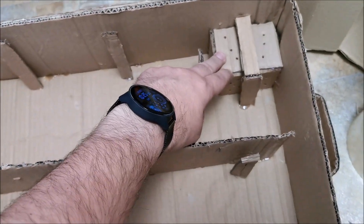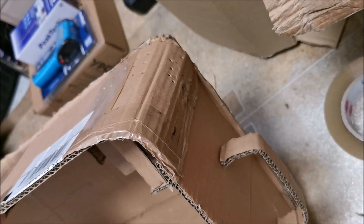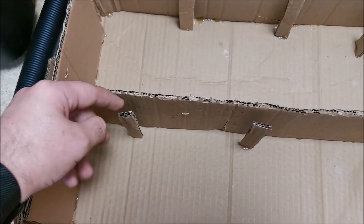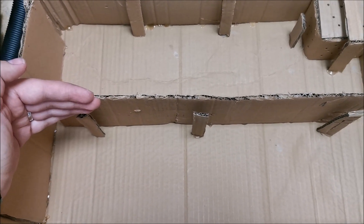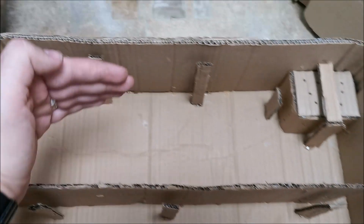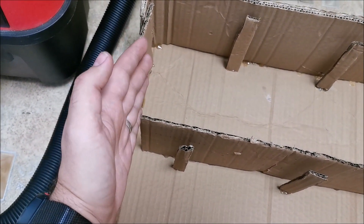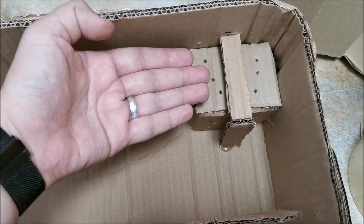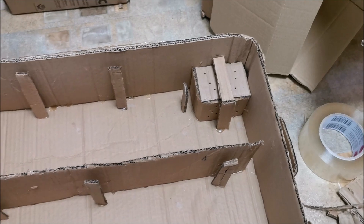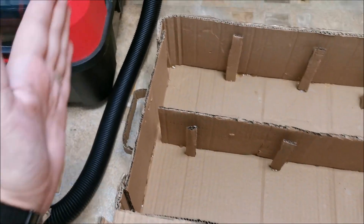We have a vent here which will have holes drilled in it — basically it's a box within a box with holes on all sides, and also holes to the outside, so fumes can escape but fire shouldn't be able to go there. I will put that temperature-resistant, fire-resistant gypsum board between this and the metal sheet — so this will also be metal — to keep that in place. Every single side will be kept in place by these things, sliding like that. Even that area will have gypsum boards with small holes in it to let fumes out — hopefully never, but just in case. The cover will have edges that come over this.